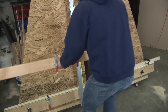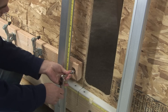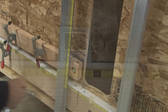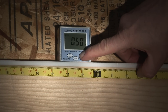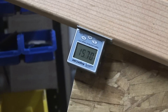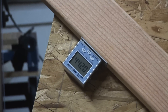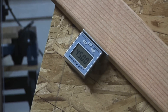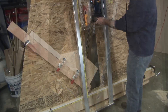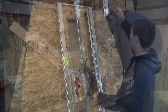If you need to miter, no problem — just put a miter fence on. Drill a hole in the OSB on the back, put a T-nut in, and bolt on the miter fence. By the way, that is a 2x4 and it will cut 2x material. We zero the digital level, bring it up to the desired angle, and clamp the miter fence on the back with a C-clamp. Secure your workpiece and you're ready to go. We can miter a piece up to 36 inches wide on a 45-degree angle.